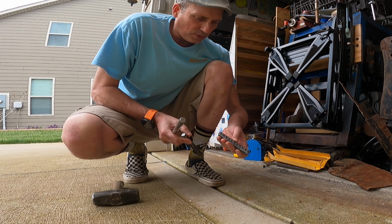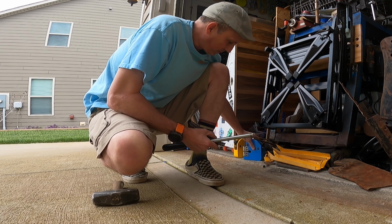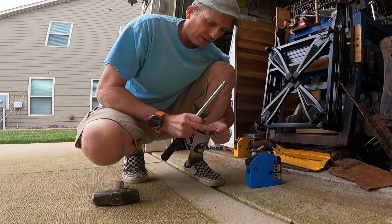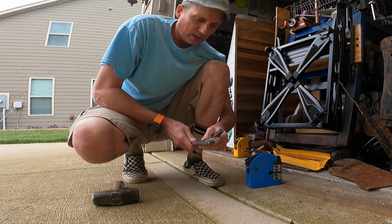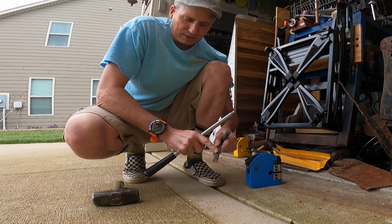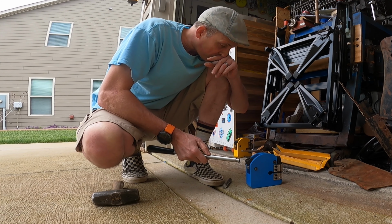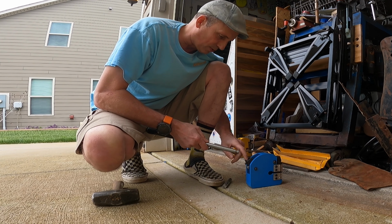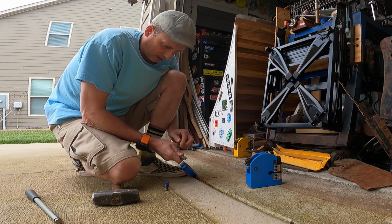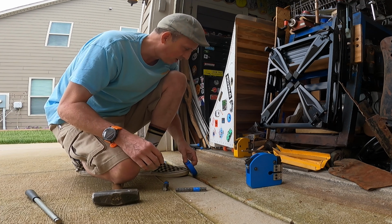So these pieces of rebar that I'm going to be using for my handle in the shrinkers and stretchers, I need to turn the end of it down a little bit to the same size as the handle, which basically just means getting rid of the ridges on the outside of the rebar. So I'm going to have to grind that off so they'll fit in here. All right, got our depth marked, so we need to clean those off.